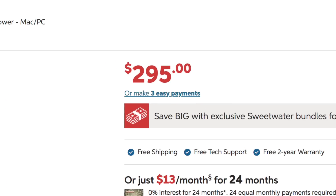In terms of cons, this microphone is just very expensive. The preamps weren't as quiet as I was expecting given that they are from Apogee, and there's no zero latency monitoring. For electric guitar, I was not impressed at all — I set the microphone up so it was nowhere near clipping, with my amp at 1.5, but it sounds like I'm overdriving the microphone. On acoustic, it does have a full low end but sounds a bit claustrophobic, probably because it only extends up to 16 kHz and doesn't have a full air frequency range to let the instrument breathe.